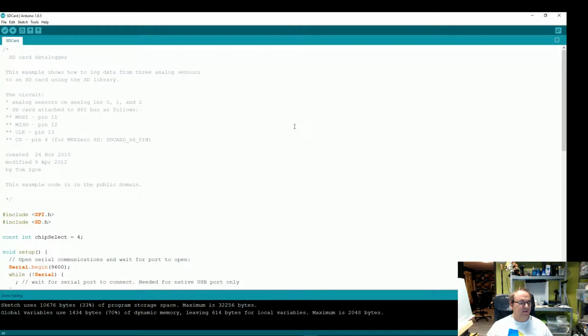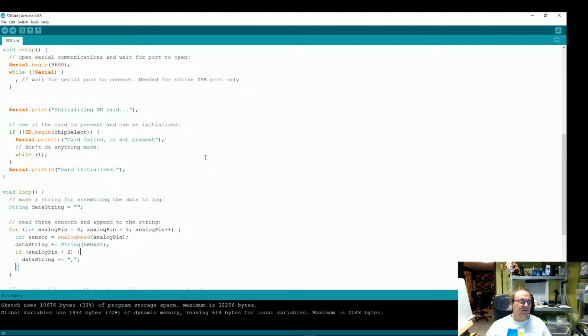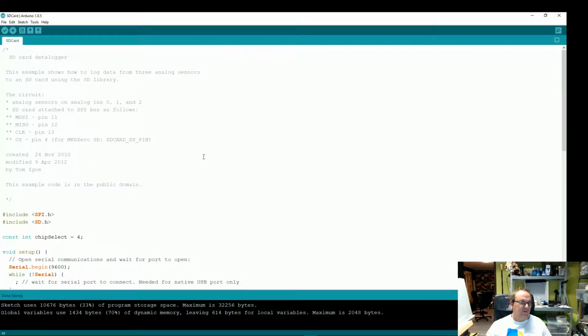It shouldn't be any problem. Even the connection information is given here, at least for the Uno. And the website I found had an example of how to connect to an Uno or a Mega card, and these are pretty generic functionalities. So I think one can connect them to an ESP32 or whatever. I haven't actually looked at how you redirect the pins to different pin numbers, but I think it's probably configurable somewhere. The quick look was that I used the default pinout. I don't know if it's necessary to use the default pinout, or whether you can go into some location in the header file for this module and give it different pins. But it's probably easiest to run it on the default pins.